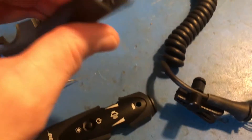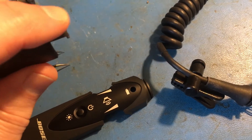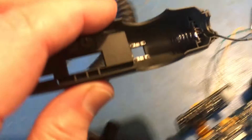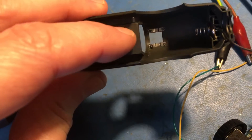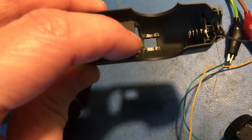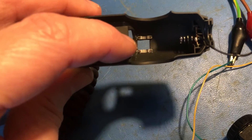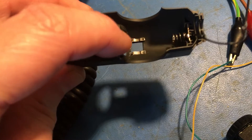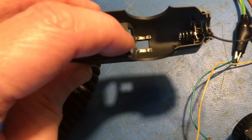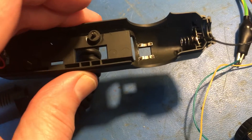You need to be very careful with the battery compartment lid. It's got two very small bits of plastic on the end and I would imagine they're very prone to snapping off. They locate inside two metal strips inside the battery compartment, and these metal strips are only held on by small plastic spigots which have been melted to hold them in place. When I took it apart, one of these was missing and was floating around inside the circuit. I thought this might be causing the failure by shorting something out, but that was not the case - be careful, as it's very easy to dislodge them.